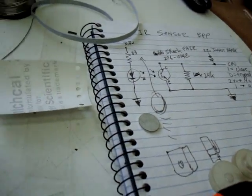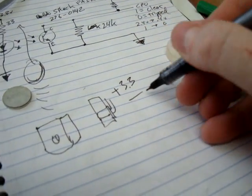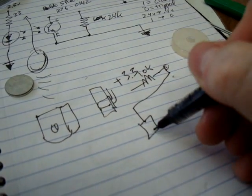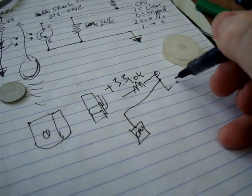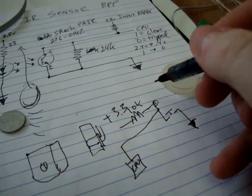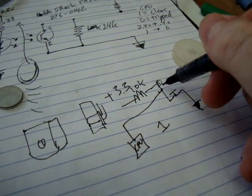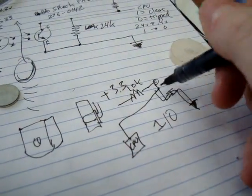On Bill Paxton Pinball, all the switches work pretty much this way. You've got positive 3.3 volts going through a pull-up resistor, usually 10K, and it goes into a switch. This also goes to the CPU. There's a switch that goes to ground. When something on the board gets hit — like a ball impact or really anything — the switch closes. This used to be high, a 1. When the switch closes, it goes to ground, making it a 0. The reason you have the pull-up resistor is otherwise, if you hook these up, you'd have a short circuit.